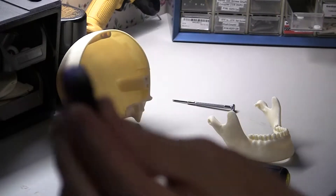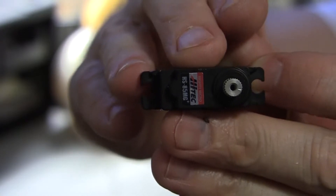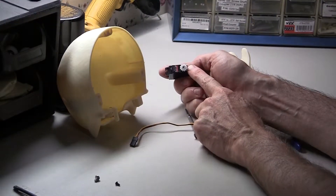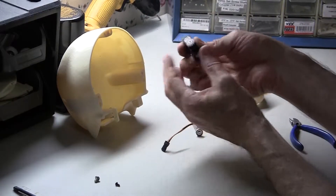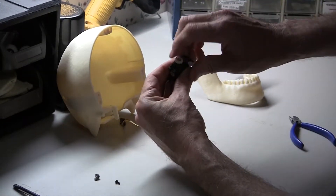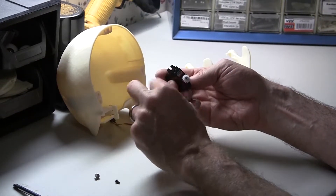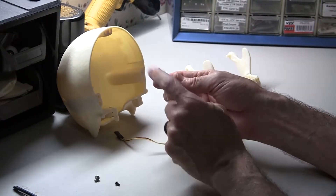You'll see this is the Metal Gear servo — if you focus on that top, the HS85MG with the Metal Gear, as you can see. Once you have this gear on the servo, you want to turn it with your fingers — you can spin this gear. It's a little tight but it works. You want to turn it all the way counterclockwise until it stops. That's going to ensure it's set in the right position for all of the routines and their programming with the servo settings for the jaw. So all the way counterclockwise and just leave it there.